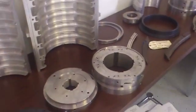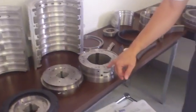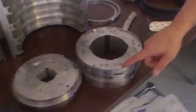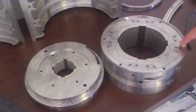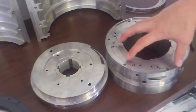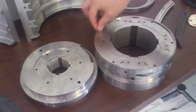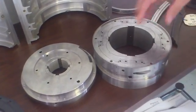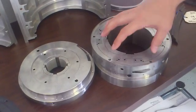The integral squeeze film damper has integral springs EDM'd in its housing that separates the inner rim that moves — that precesses — with respect to the outer rim. This outer rim here is stationary, and it interfaces with the inner rim through these integral springs, which are EDM'd in place.